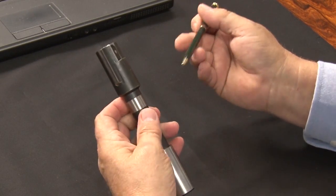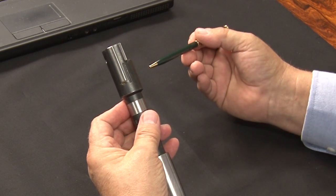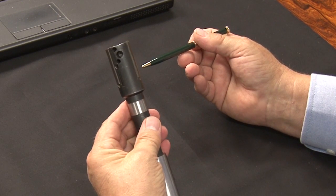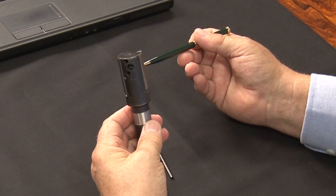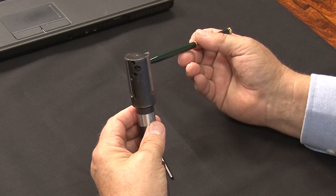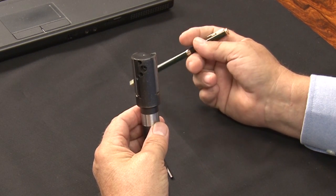The pad is positioned lengthwise by a stop pin to ensure that we have the right blade advancement. Adjustment screws make sure the blade cut diameter is positioned diametrically very close to the pad diameter. Because blade and pad diameters are so close, it cuts exactly to your required size with an unparalleled round and straight bore.